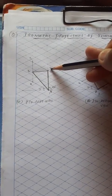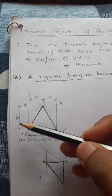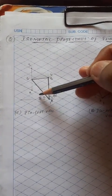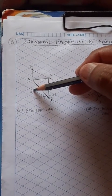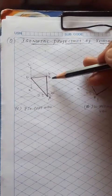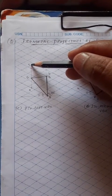Similarly, along the 150 degree line — that is dimension 1 to 4 — it is 25 mm, which is 2.5 centimeters. Measure two point five boxes, exactly at the middle line, and name that point as 4. From point 4, draw a vertical line; from point 2, draw a 150 degree line. The intersection point is called point 3.